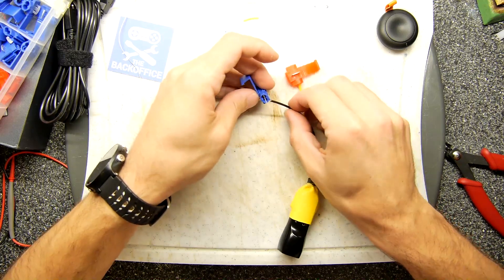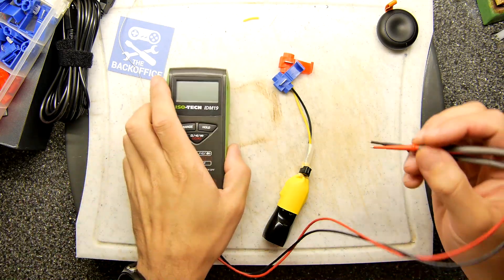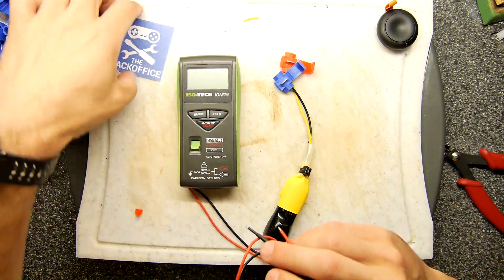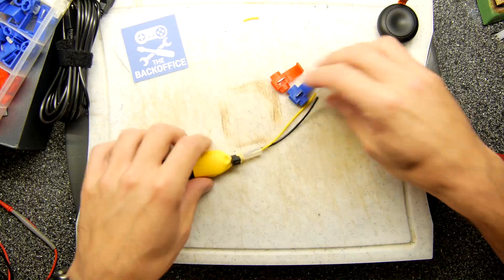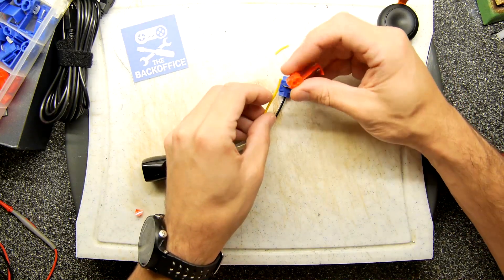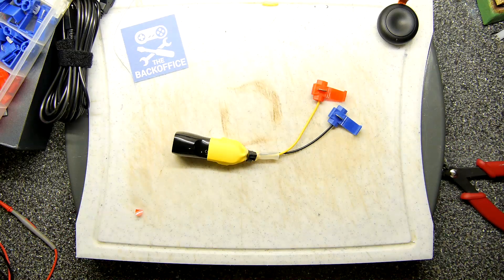I really do suggest you buzz out something near the fuses from the fuse box. If you have a wiring diagram, great — use a sort of accessory circuit. If not, use a multimeter to just check it's a circuit that comes on with the accessories. There is actually a fuse inside this so it is fuse-protected from shorts, and then you can mount that behind the back of your dashboard somewhere. I hope that's been of some use for you — please feel free to comment down below, like the video and click subscribe. And as ever, thanks for watching.